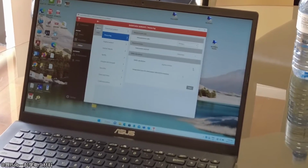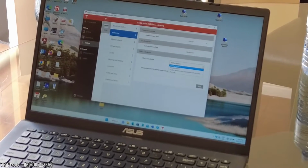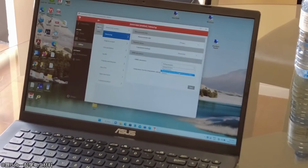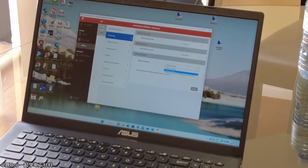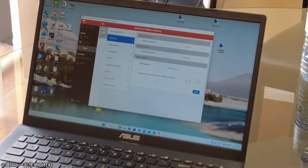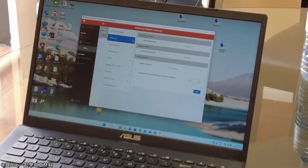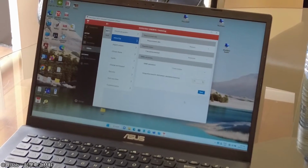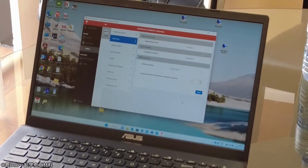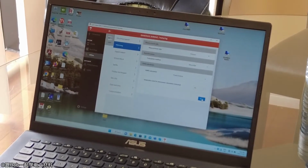What they do is they integrate the kilowatts over a period of time, and typically it's either a fixed window or a sliding window. If it's a fixed window, typically it's 15 minutes. That's what we use here. You can have it calculate at 15 minutes, wait another 15 minutes, or you can have it do the first 15 minutes and then update every minute after that. Either one. Right now I just set it for fixed window.